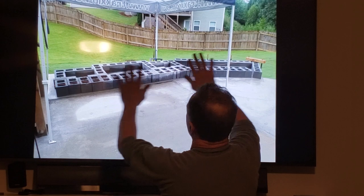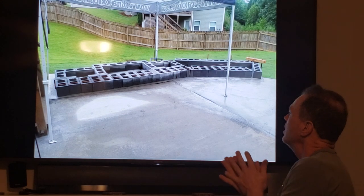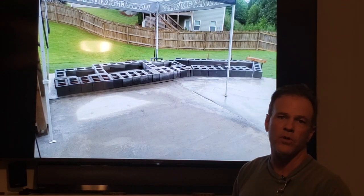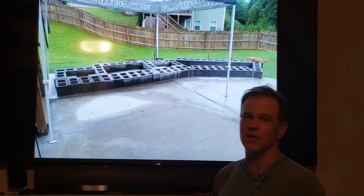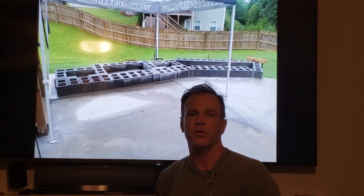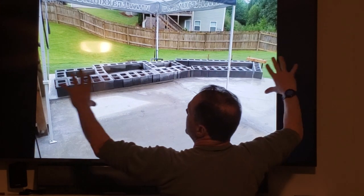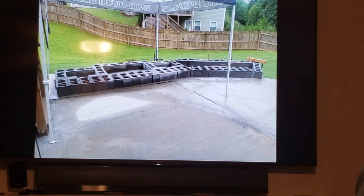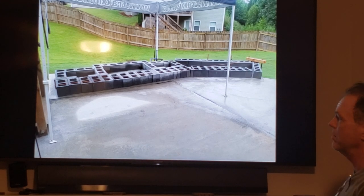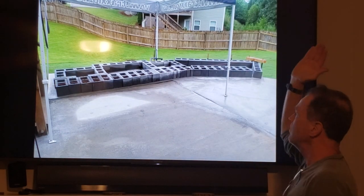What you see here is my beautiful site that I've laid out and imagined in my mind. When it comes time to lay blocks down, guess how it works out? Blocks don't touch in the masonry world. Mortar goes between blocks. That's what makes blocks stick together. So, if we had 3/8 of an inch of mortar in between all of those blocks, now my project is so big that it doesn't fit on my pad anymore. Huge problem, okay?